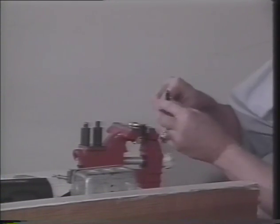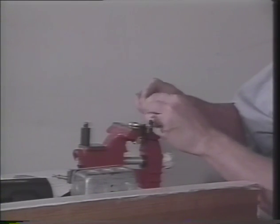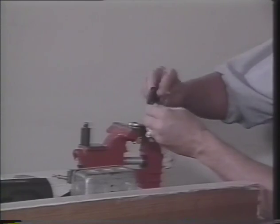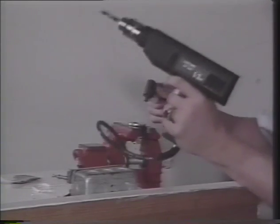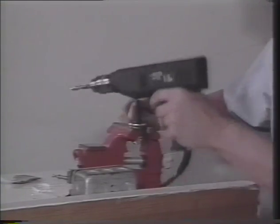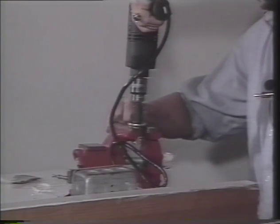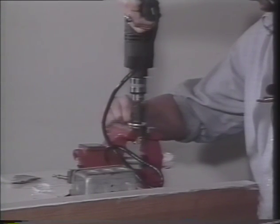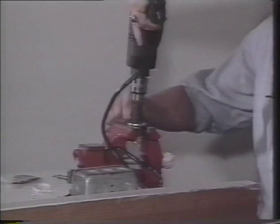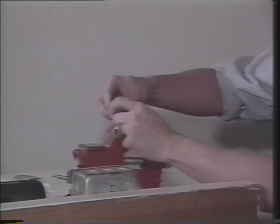It consists of a couple of pieces: a drill guide, a handle that screws into it, and a very good hardened bit. It will go through most locks almost instantly. To use this, you line the drill guide up with the cylinder, put the drill bit in, and drill. Once you've drilled into the cylinder, many cylinders can then be popped out.